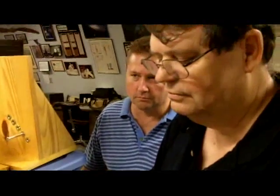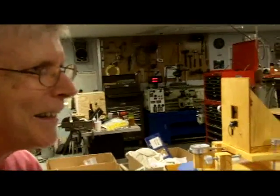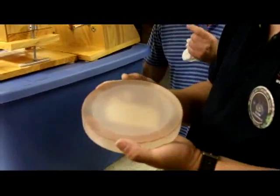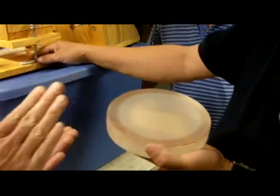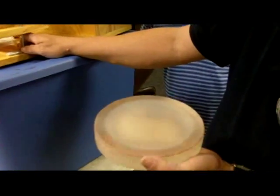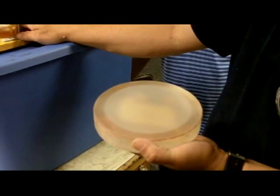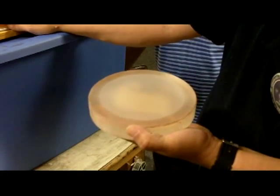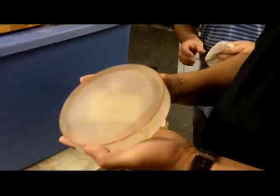Because I started off with a 16th, and I kept having to go back and do more bevel. Without that bevel, it could be razor sharp, and it's super sensitive. You just barely touch it, and a big chunk of glass just comes out. Then you're stuck with a chunk of glass gone from your mirror. And every time you look at that mirror for the rest of your life, you go, see that chunk that's gone? I did that.